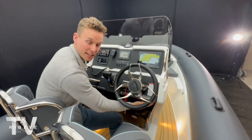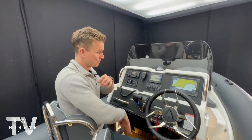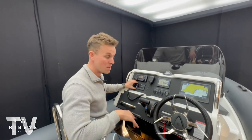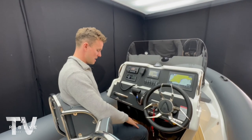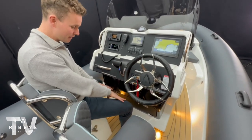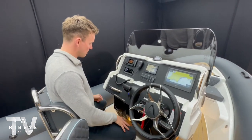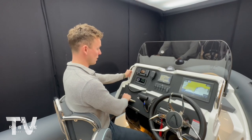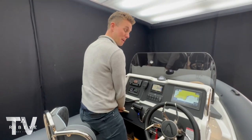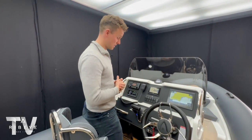Underneath here you've also got your isolator switches. This boat has dual battery - a house battery and an engine battery - so if you go to the beach you can turn the engine battery off and just run the house battery while enjoying your stereo system as long as you want. Ergonomically you've also got a foot plate, a reverse angle moulding where your toes go underneath the console maximising floor space. From a passenger perspective I can really hang on with handles at different heights, shoulders square - I could even stand up in a big sea and use my legs as suspension.